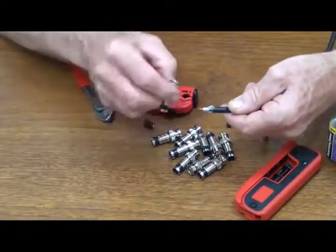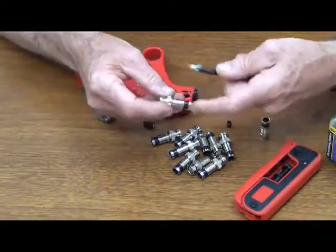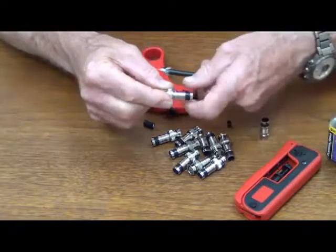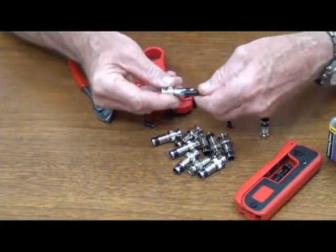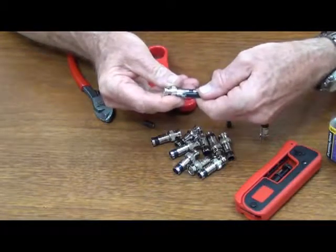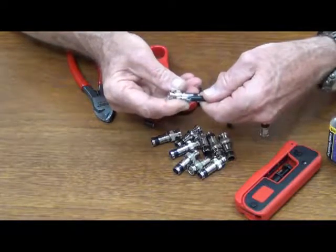Something real important with BNC — you're shooting blind. With an F connector, you can see where you're at. With a BNC or an RCA, you can't. On the BNC, the callout for the center conductor is 3/16ths of an inch. You can use the connector itself as a measuring gauge for two things: one is for the center conductor, which is the width of this band ferrule right here. When you put the dielectric at the base of it and look at where the end is — I'm close to the edge, so I know I'm long enough. If I was past the other side, I'd trim it a little bit, because I'd be too long, and that would prevent the connector from going on where it needs to be on the cable.